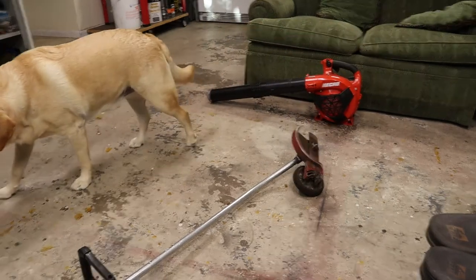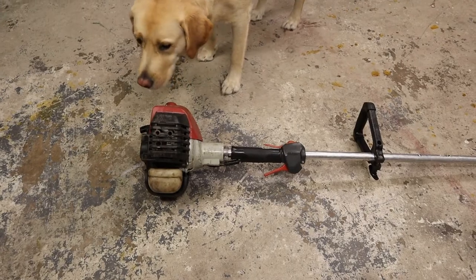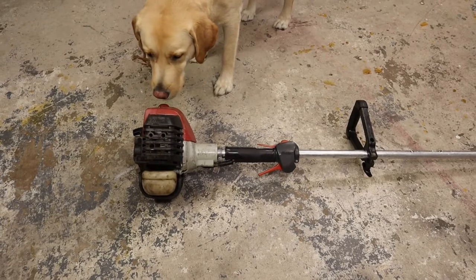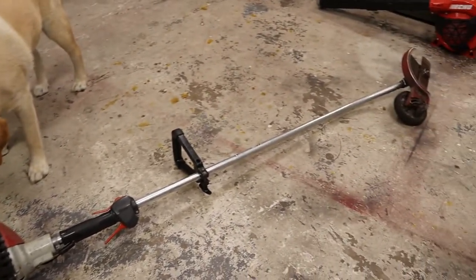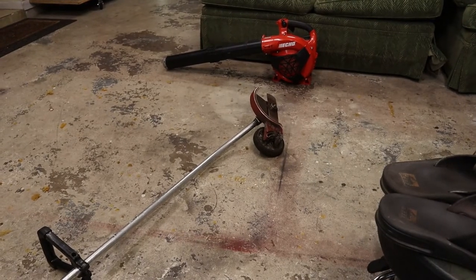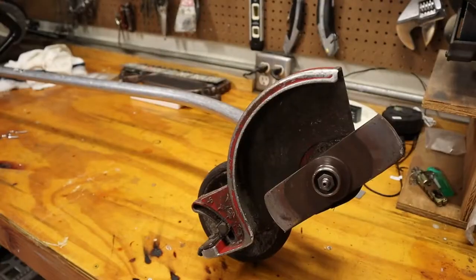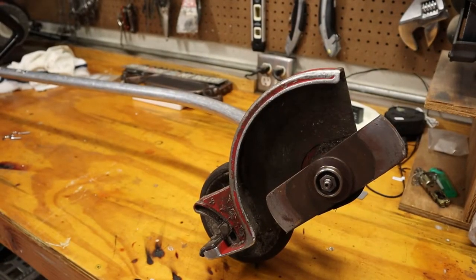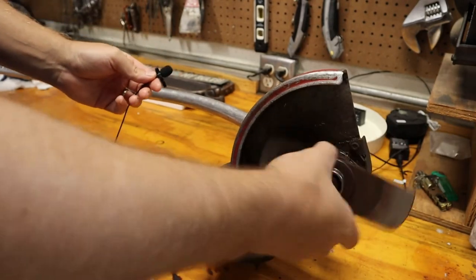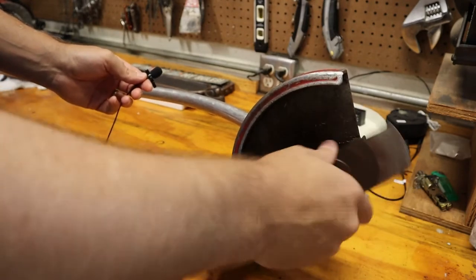Off the bat, since the engine runs, there is a centrifugal clutch in this little gear case down here - so that's a possibility. We probably have a flex cable in that aluminum shaft, so that's another possibility. Could also be something in the gear train at the bottom. My money is on either the clutch or the flex cable. I'm going to refine my guess and say it's probably the flex cable. I think our flex cable is broken.